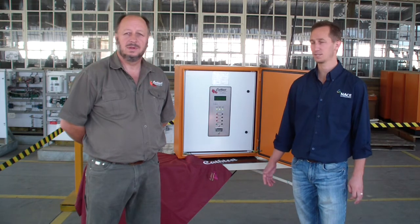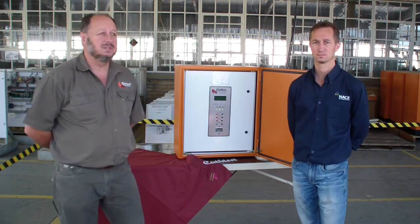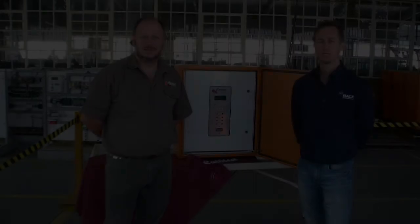So, talking about smaller units, Dave, tell us about the housing that these cabinets come in. Aaron, we manufacture them in two standard cabinet sizes and utilize three optional steel grades. It can be 3CR12, stainless steel, or mild steel. All of them are powder coated and IP65 ingress protection.